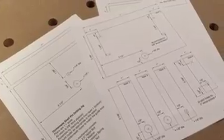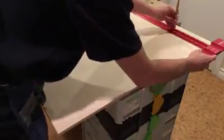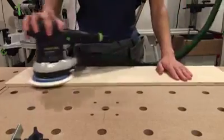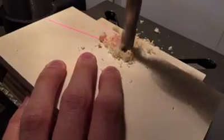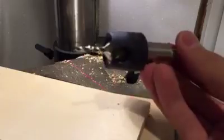And the rest of this video will go over the construction and assembly process in more detail. All the parts are cut from 3/8 inch birch plywood. Everything is cut according to the plans, so now I'll drill the holes. I'm using a depth-limiting countersink bit here to drill out the pilot holes, but this can be any regular bit.